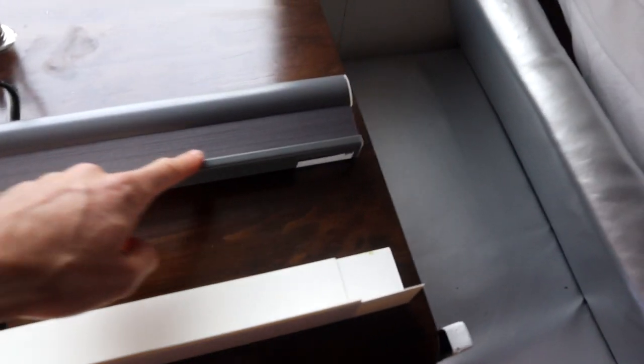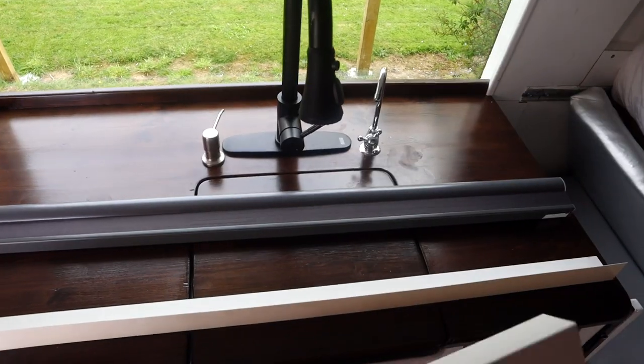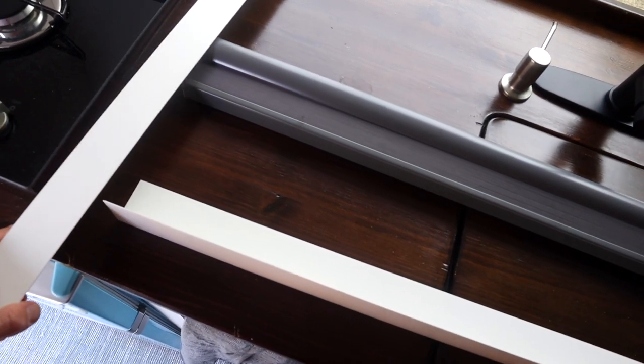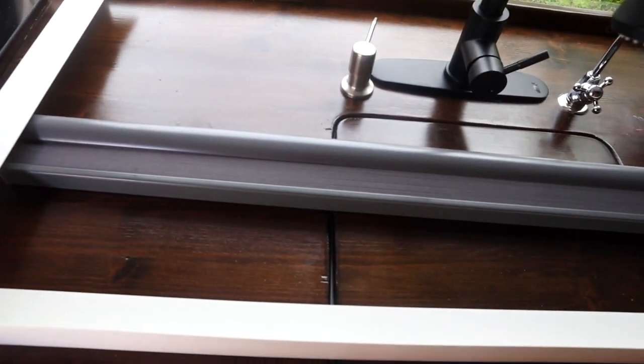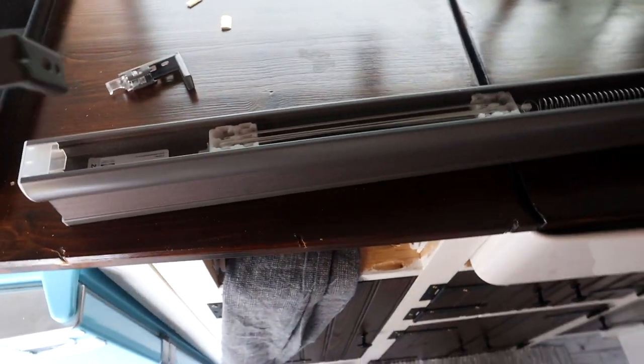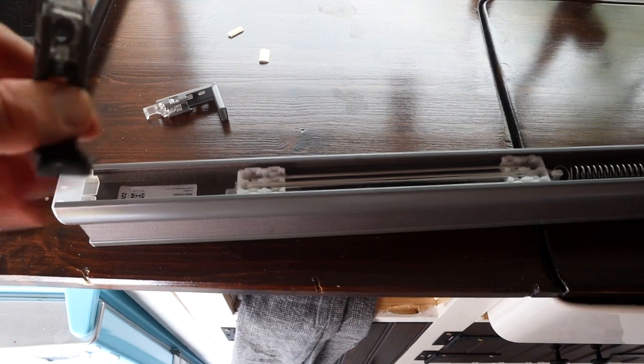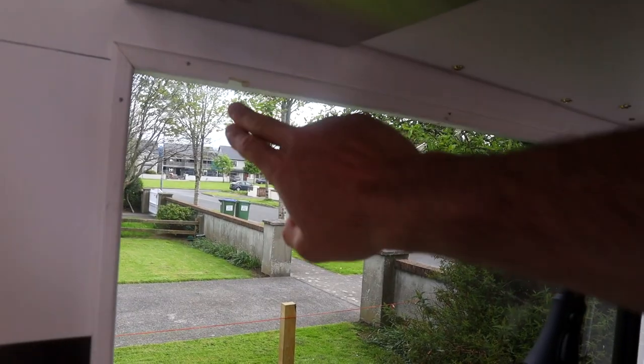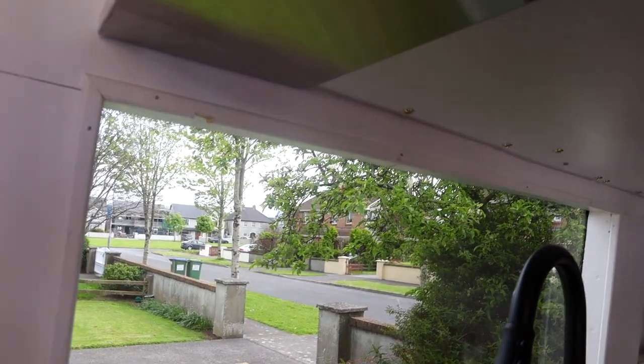This is the blind and it's going to be too short because it's only 39 and a quarter inches wide. The plan is to put one of these PVC fittings on either end so the blind slides down behind the PVC on either side. The fittings come with a clip-on bracket that you screw to the wall, but you can also screw from underneath. I'm going to secure it underneath here — I've had to take out a piece of the moulding so the fitting can go flat up against the underside.